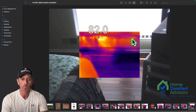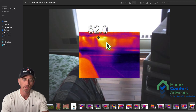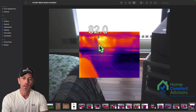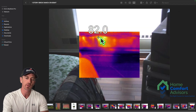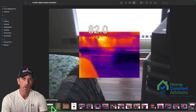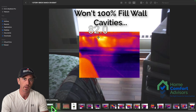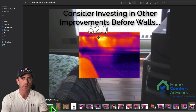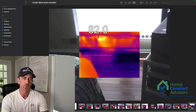The left and right sides of the trim typically get caulked because you can see them, but the bottom and top of the window rarely get caulked. When I was using the infrared camera with a blower door system running — which pulls air into the house — the camera captured this area as a big leakage point. This is something we find fairly often. If you're thinking about having injectable foam installed in your house, just be aware there are issues with it and it's not going to completely fill the wall cavities 100%.